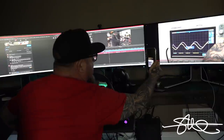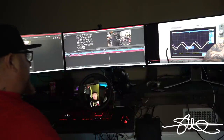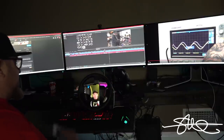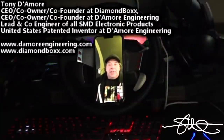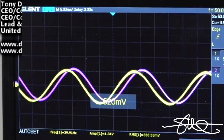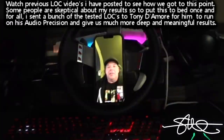See how that wave looks nice - the pink one is my input and the yellow is my output. Can you give me a basic explanation on why we're showing distortion when the wave looks halfway decent? When we're looking at the wave on the scope and we say it looks decent or clean, we mean it's not clipped or it's not a triangle - it resembles a sine wave.